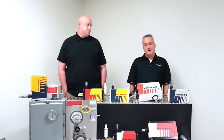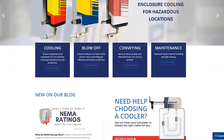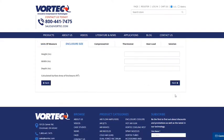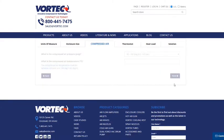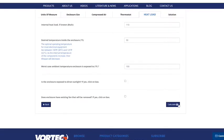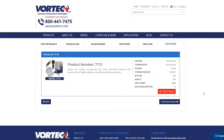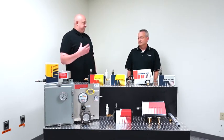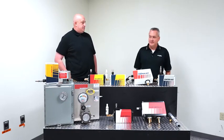So Steve, let's say I'm interested in one of our AC lines, and I'm not real sure which one is best for my operation. Where would I get started? So the first thing that you would need to do is either call the office, talk to one of our application engineers here, or go online to vortex.com and complete the online questionnaire. Basically, the online heat load questionnaire is going to ask all the questions that we need to know as far as size of the cabinet, the amount of the compressed air pressure, compressed air temperature. We need to know things about what components are inside the cabinet, and we take all that data and we use that to select the appropriate cooler for the application. Perfect. So each one of these are precisely designed for specific applications. That's correct. As you mentioned, we do have a few different varieties here.